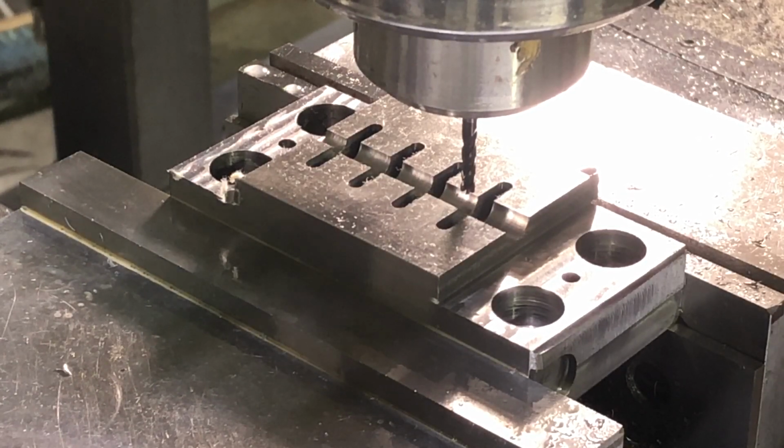All right, let's see. We're back up. Oh, I got to remember what the cut speed's supposed to be. Let me do it real quick. So that is 400 divided by 0.125, 3200. Same thing as I ran that eighth inch last time. So 3200, let me see what my VFD is set for to do that. 3200 is 53. You can't see this, but I'm just turning my VFD to give me the right RPM. All right, so 53. So that should be 3200 RPM.